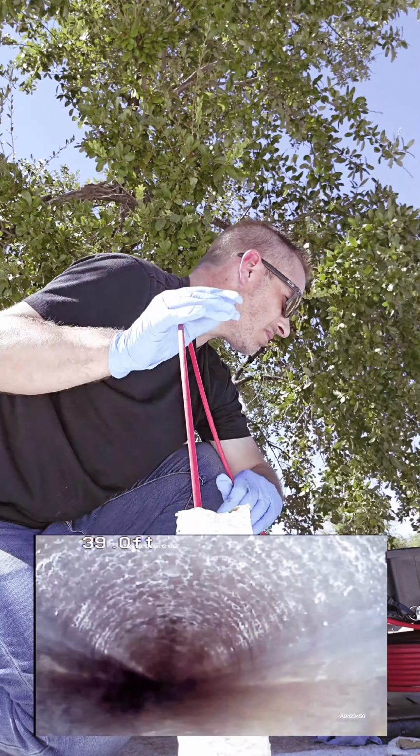This is probably the drain around the kitchen sink. You can see the grease that's built up around it. It's typical for a kitchen drain. Looks like we have an opening there at 68 feet from the line. That could be the cleanout in the yard somewhere that we have to go through to get it.